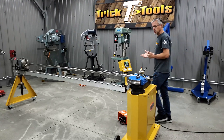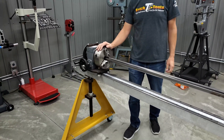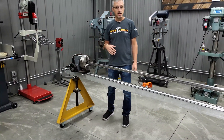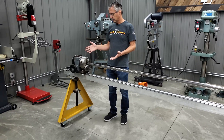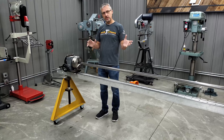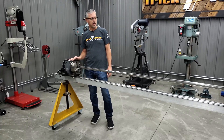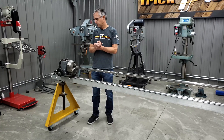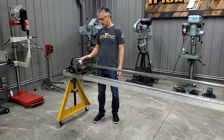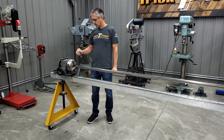You can see a couple of features on this positioning table. Number one, there are wheels on this end. This is designed to swing, and that's important. We've had customers before that wanted to make this fixed, but with this type of machine the tube is actually allowed to pivot, so this has to have wheels and be allowed to swing a little bit freely. If it doesn't swing like that it can affect your bend quality. One tip I always tell people: make sure this is rolling freely. If you have a rough concrete floor in your shop you may need to put down a sheet of aluminum or steel to allow this to pivot.